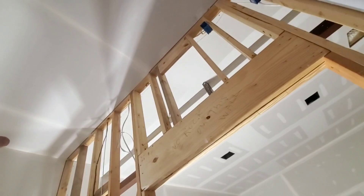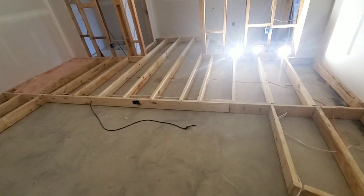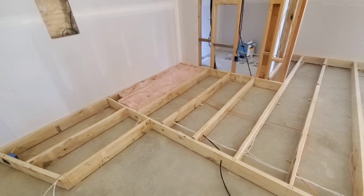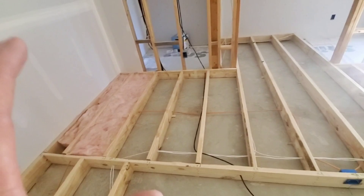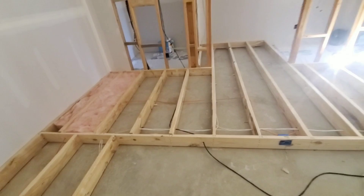We're going to have the return on the eight-foot ceiling, so when the door is closed it's going to pull a lot of air through that vent. The projector — the JVC RS 2000 — is hanging right here; it's going to keep that area nice and cool. The acoustic fabric is breathable so it'll pull air right through to the return. For insulation we're using R19 — this is made for 2x6 depth. I've seen people use rock wool like two or three inch pieces in their risers; you may as well throw your money in a river. Rock wool absorbs just as well per inch but you need a full fill to absorb the most resonance at lower frequencies, and regular fiberglass here is much cheaper.